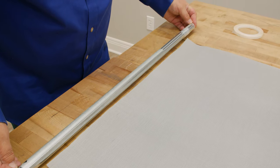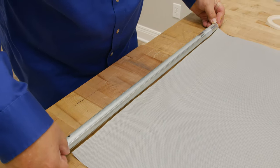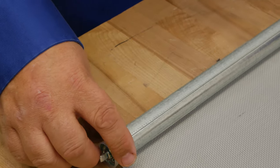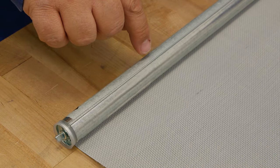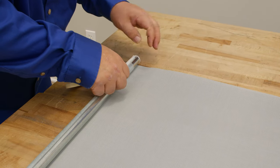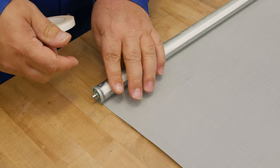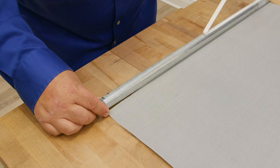Now we're going to reduce this telescoping pole down to the width of our fabric, making sure it's a little bit long — about an eighth inch over where the tube ends — because I'd rather have more rod than fabric. Then I'm going to place double-sided tape. It's going to roll like this on, so I'm going to put double-sided tape on this side of that joint. That way we can use the joint as a reference to where the shade material goes on straight. This is Seamstick for canvas — even though it is a vinyl — it's got more aggressive sticky tape.